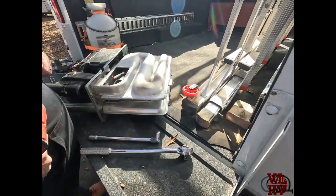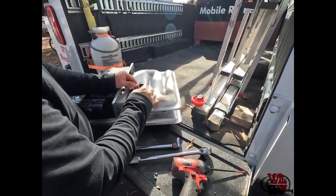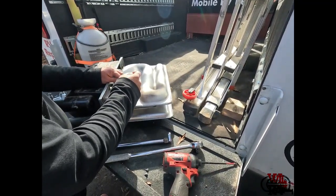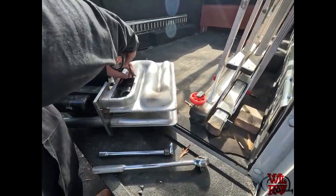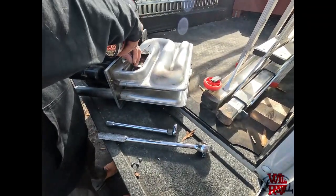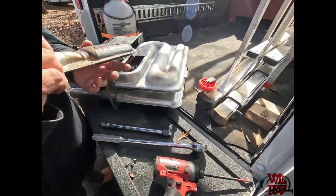I'm just gonna go ahead and take the burner head out of here and let's just make sure that everything's looking good. So that's our igniter there. And it looks great, you know. I don't see any cracks in the ceramic. It doesn't have a bunch of carbon buildup on the tip. Looks good. So you evaluate those kind of like a spark plug? Yeah, pretty much. If it's got a crack, then you replace it. You can clean the carbon off the tip though. A little bit of brake cleaner and some very, very fine sandpaper or cheesecloth, something like that.